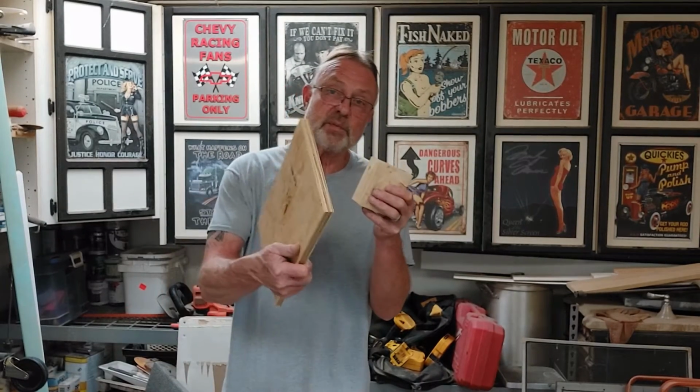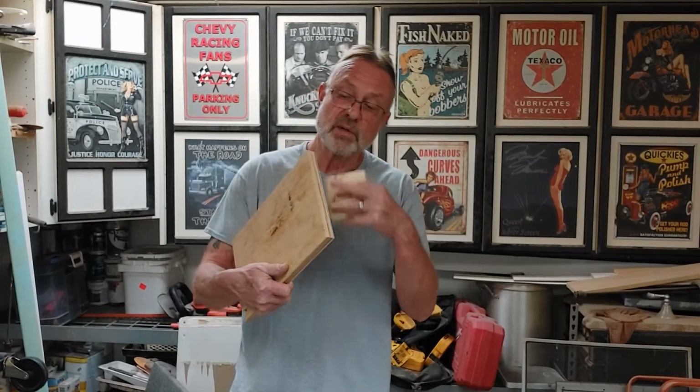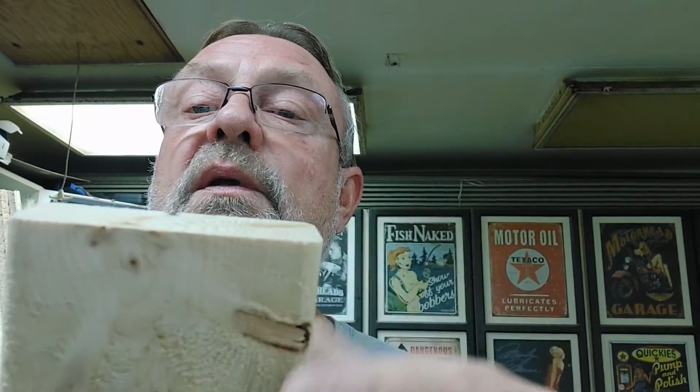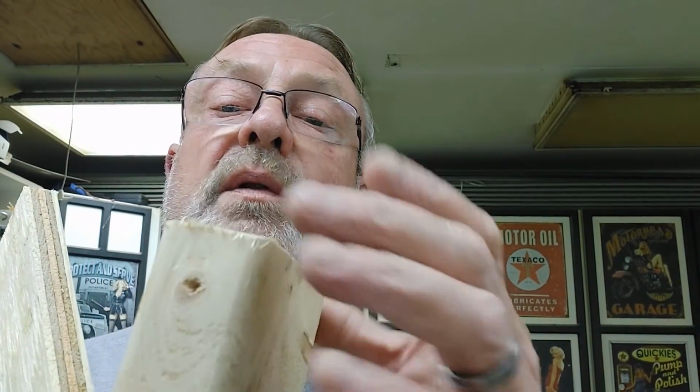I also have a piece of plywood here to show you that there's very minimal chip out. So as you can see, the edge of this is very clean. There is a little bit of material here from where it exited the blade. That is common. A sharp blade will do that. The other side is also very clean. Very nice sharp blade. This is the factory edge.